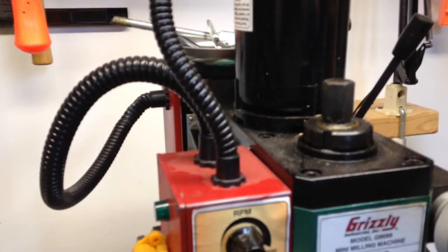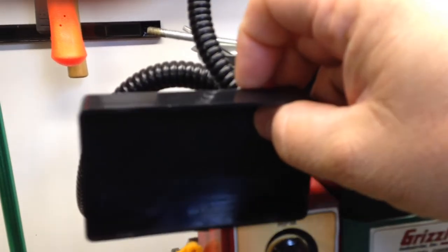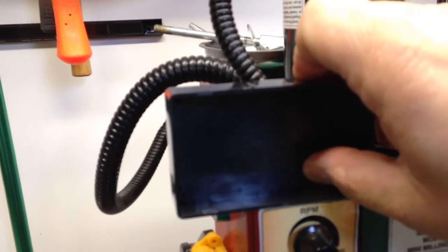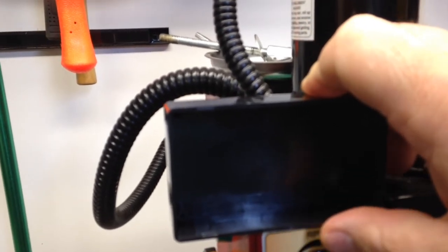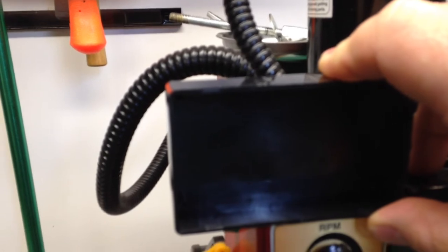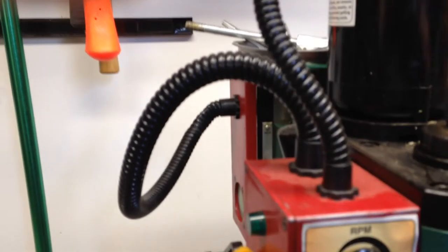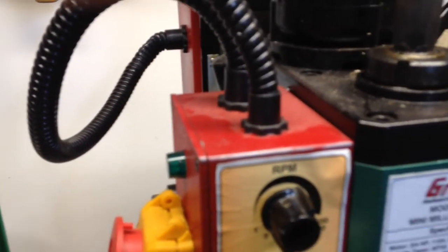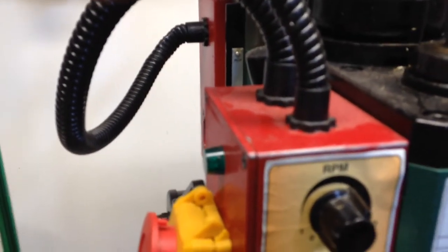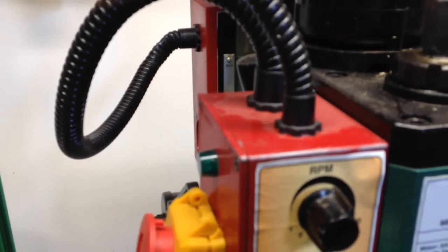All right, so when thinking about how I'm going to attach the box for the readout of the tachometer, I thought, well, I want to be able to remove it at some point. And so I settled on drilling and tapping right about here and here, two screws. And I think I'll use a number 6-32 screw, kind of a light fixture type screw.